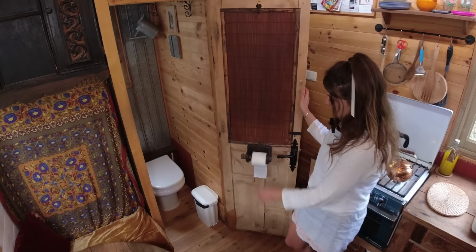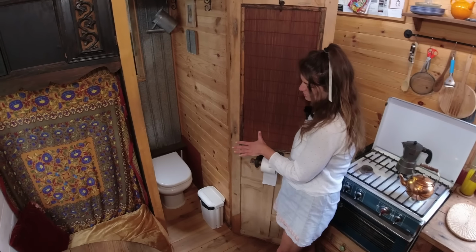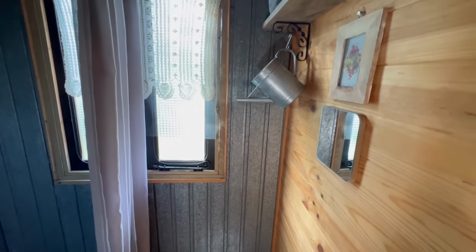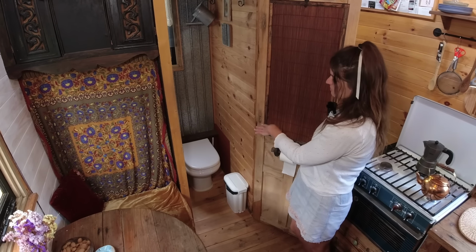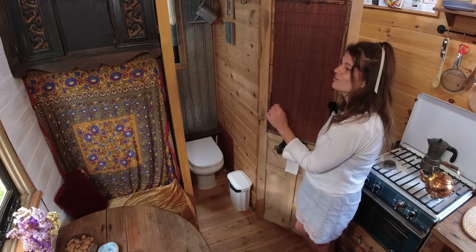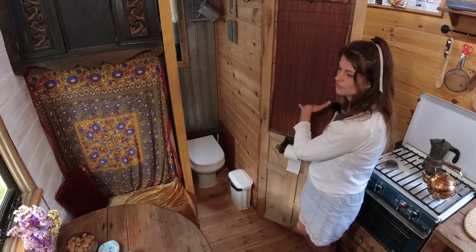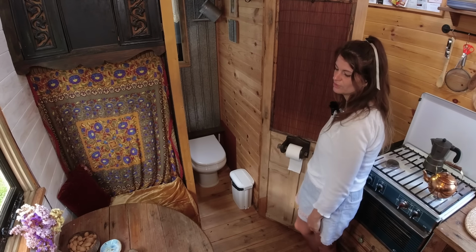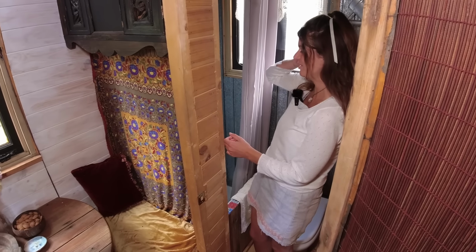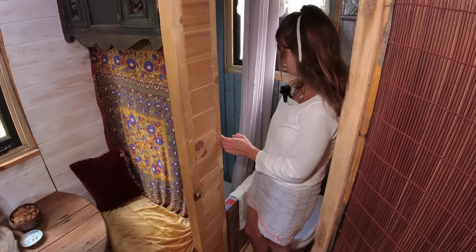And then, when I first built the house, I had a totally composting toilet, but now I put in a normal toilet pan, but it doesn't have a flush. So I built a natural soak outside. So when you use the hose from the shower to flush, it goes into a natural soak in the ground. Just past the toilet, you've got a full-size shower in here. This is also where the flush for the toilet comes from.